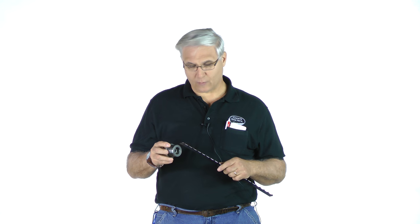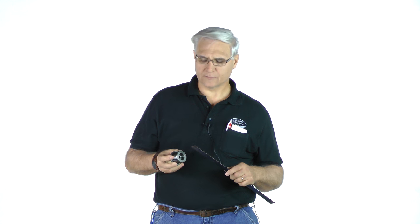Very important, the roller guides. There are two of them on each mill, and they sit on the bandsaw blade, and they're what gives you your alignment, or part of your alignment. It's very important. We build these roller guides. They are specially hardened, and they will wear out over time. That's why we harden them. But it's important to have roller guides that are in real good shape.